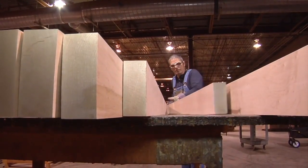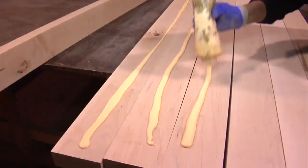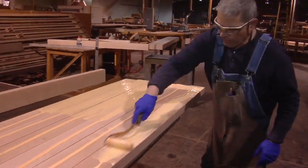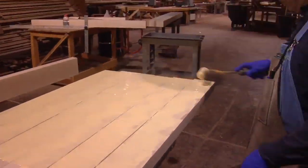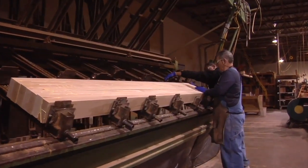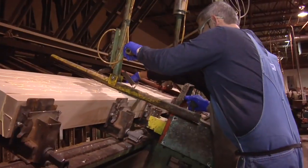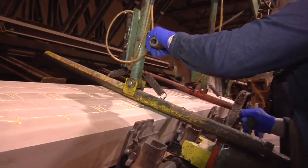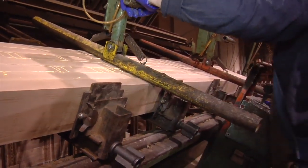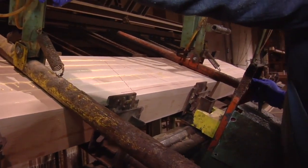There's a lot of attention to detail. The glue is applied and rolled for a good, tight bond. Here's where the pressure is applied. The bar on top will keep the top flat and the sides will push together. You'll see them applying pressure from the side also, and the glue will creep out. That's why there's not much of a need for overkill on glue.